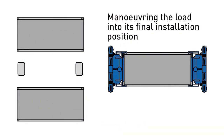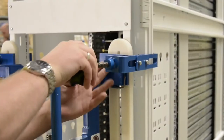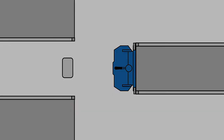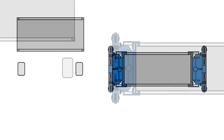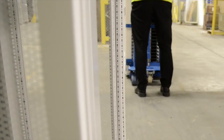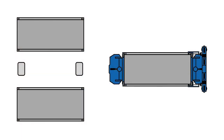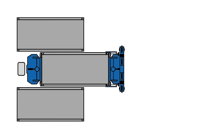Maneuvering the load into its final installation position: remove the outrigger and all four adjustable clips from the leading scoots unit. Note: when the load is being installed beside an already sited data enclosure, for example on the end of a row, only the two adjustable clips from the leading scoots unit on the closed side need to be removed. Push the load into the install area, ensuring that the wheels on the scoots unit are tracking in line to avoid contact with the seismic floor plates. Ensure that the trailing end of the load is positioned approximately 15 inches or 40 cm proud of the front seismic floor plate, and thereby short of the rear seismic floor plate by the same distance.